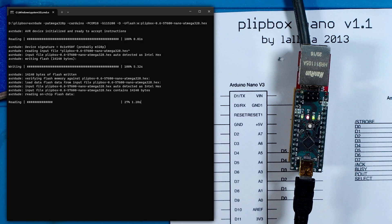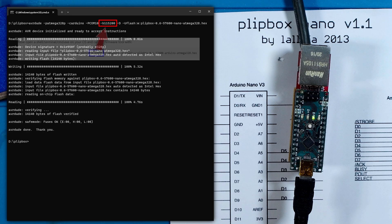One little note here is the baud rate parameter. In the original documentation you might see it written with the number 57600 instead. This is because older Arduino Nanos use an older bootloader that runs at this slower speed. The newer ones run at a faster speed, and if you don't get it right it won't do anything.